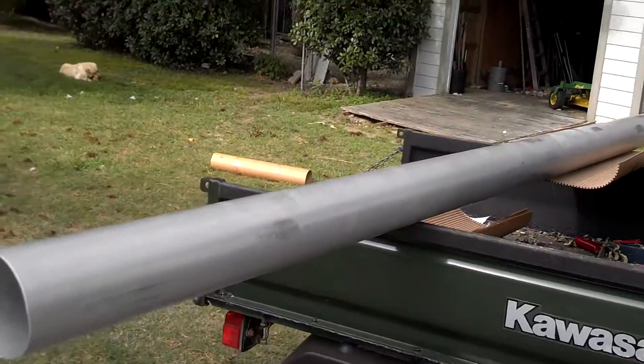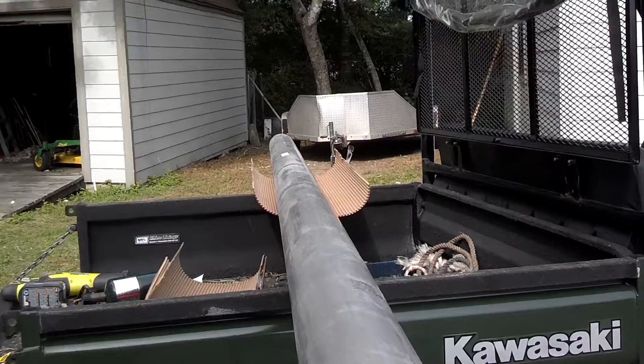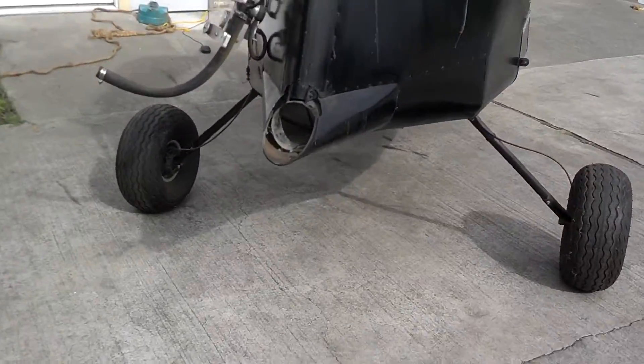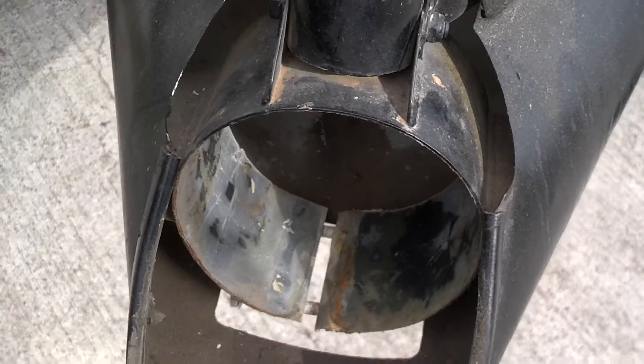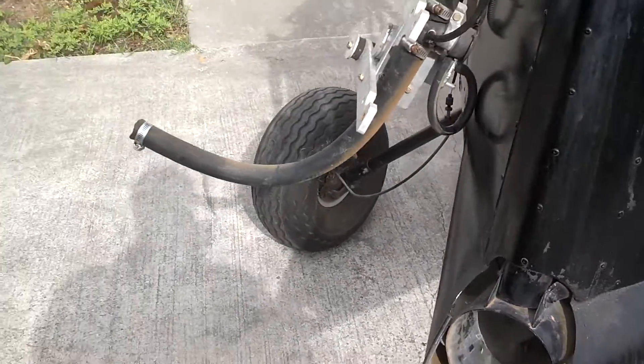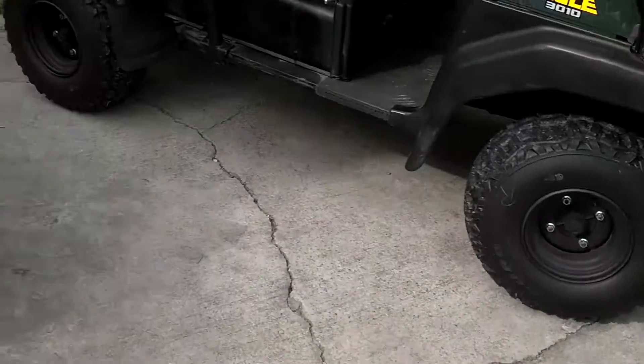Rand's was nice enough to send me a new tail boom for only $850. If you look inside of this one, you can see the sleeve that's inside this tail boom — that is what the upgrade calls for. Evidently, when you insert the tail boom and you clamp it right here, that's a stress point. So if you have a hard landing, that tail has a lot of moment arm, and it could probably collapse that tube there. I don't know that they ever had any trouble like that, but I'm assuming that's what the directive is about.